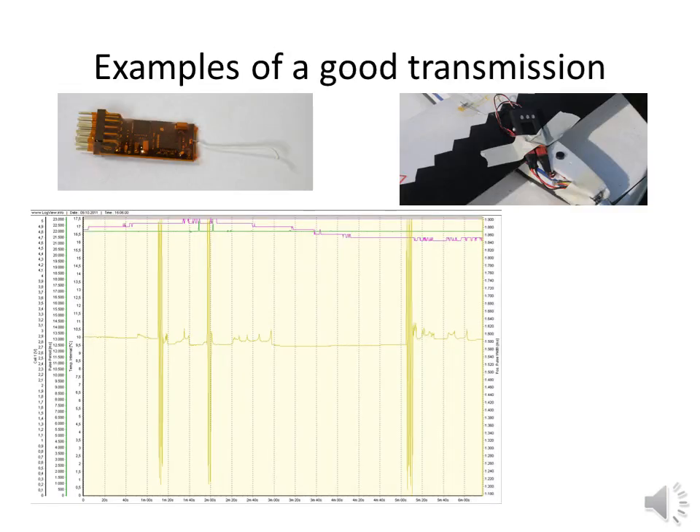Now we come to the first result. This test was performed with an Orange 4 channel receiver during a flight with the receiver controlling the plane. The test provided a straight signal with no disturbances. The purple power line at the top of the graph for the receiver voltage is straight at 5V. The yellow line for the servo signal is exactly what it should be, and the green line for the frame duration is a constant 22 milliseconds. The internal temperature of the data logger is also measured, just as a check to see if all measurements are plausible. This is how things should be.